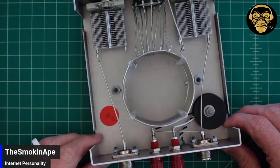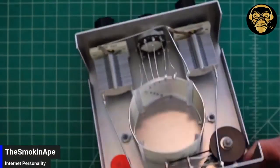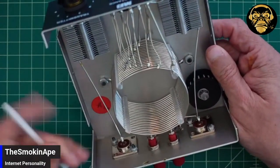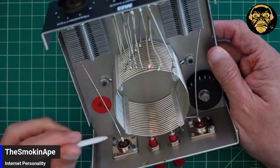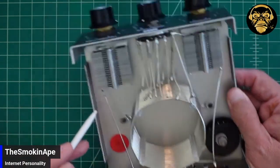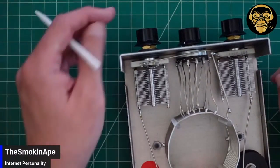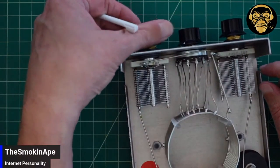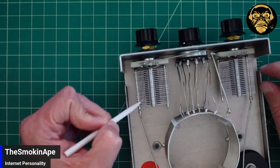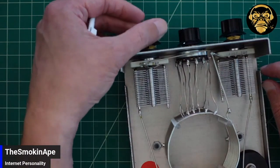So this is the guts. Let's take a look. This jack here is the transmitter, and you can see the center conductor — it's just grounded through the case, so there's no ground coming off of here. The center conductor comes down and goes into our first component, which is the capacitor, just like in the picture of the T-network. You get a capacitance value based off of the relationship between your stator and your rotor here.